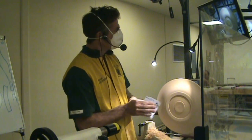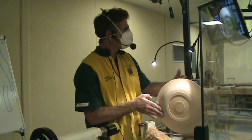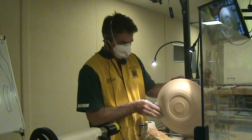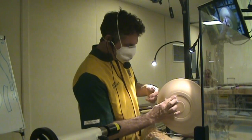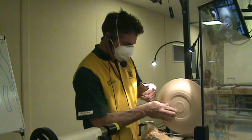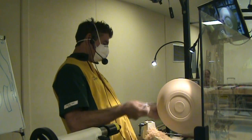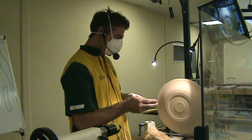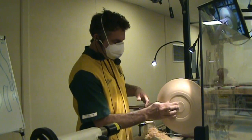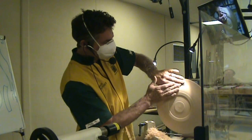What causes sandpaper to hurt itself is if you take that paper and throw it right up against the wood — you've just destroyed the paper because that heat builds up immediately and knocks the sharpness right off. I'm very particular about sandpaper because it costs so much. I always slow it down considerably because that's what builds up your heat. I turned this at 1200 RPMs and I'm down to 500 here to sand.